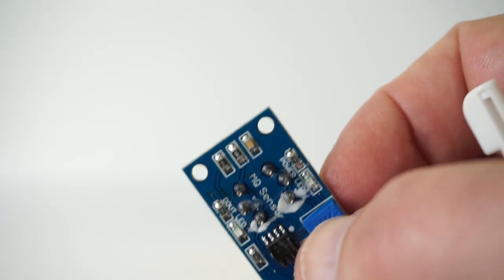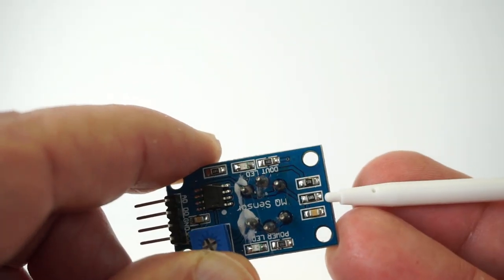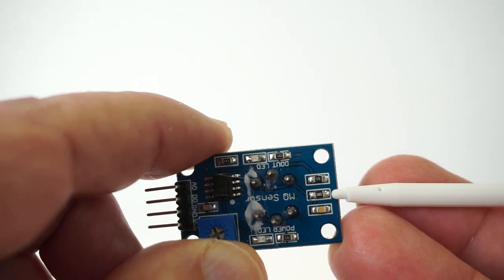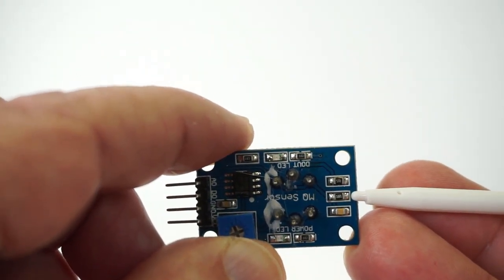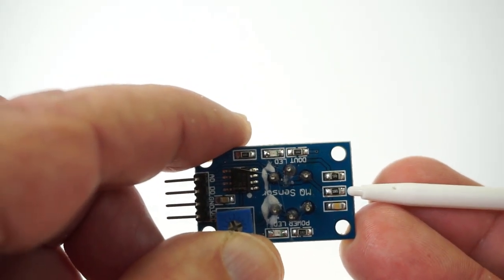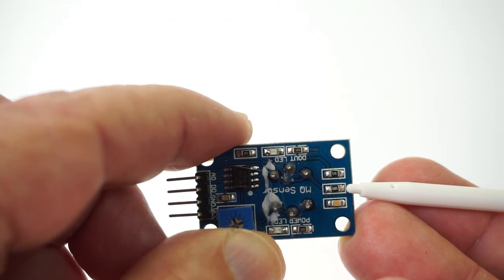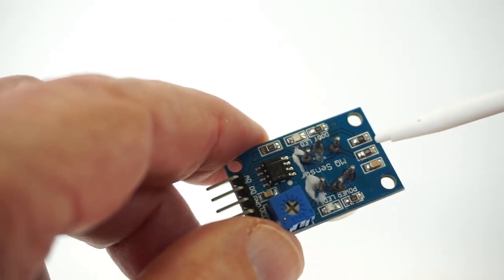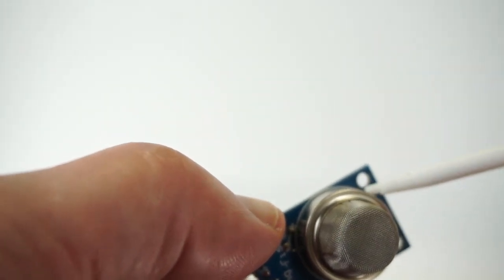So it's all easy as that, right? Well, not quite. There's a fly in the ointment. I don't know if you can see this resistor here in the middle. It says 102 on it, which means that it's a 10 with 2 additional zeros, for 1000. It's a 1K resistor. That 1K resistor is the numerator in the fraction. The variable resistance of the sensor is the denominator.